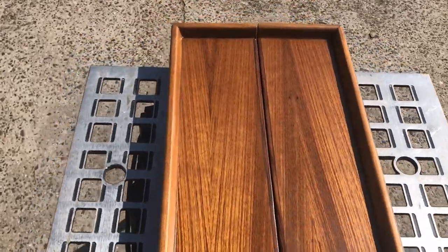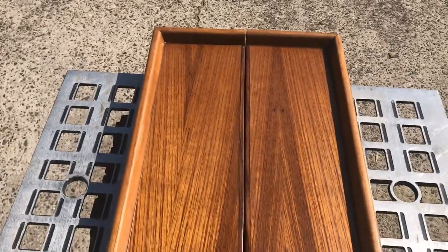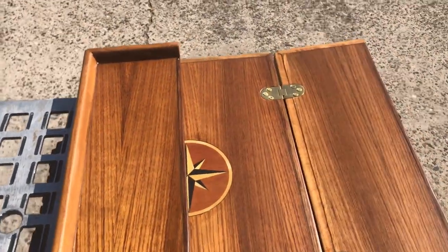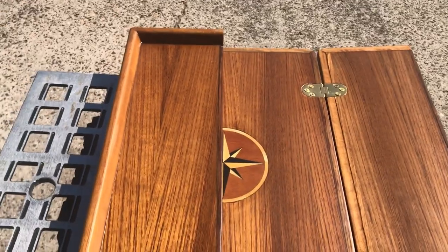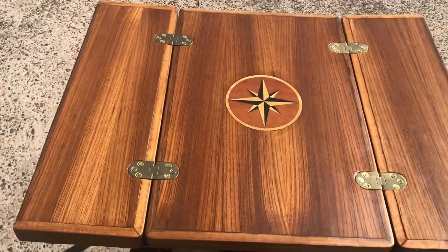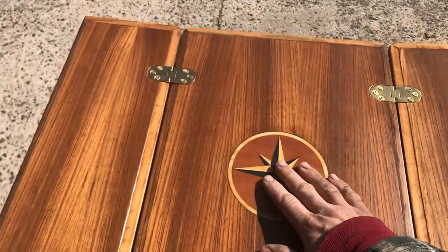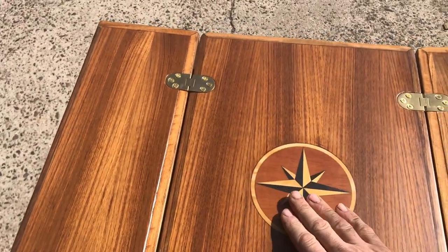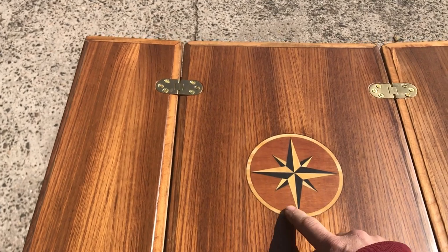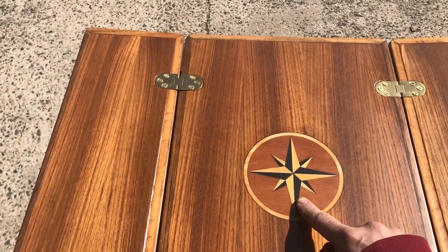Prepped this for varnish — and quite a bit of varnishing later, actually quite a bit more than average — here's what I have, and I'm somewhat pleased. This didn't come out perfect but it is a table so it's going to get scratched up anyway. I had some issues with this inlay — it actually lifted up after about eight or so coats and I had to get in there and inject more epoxy.